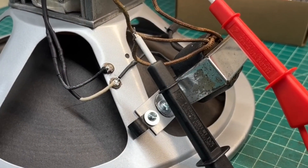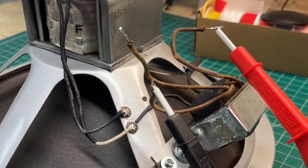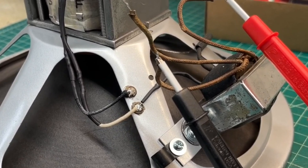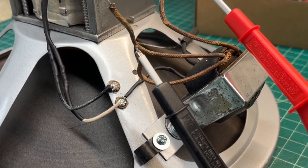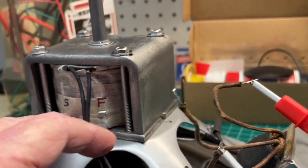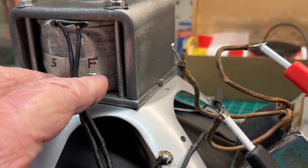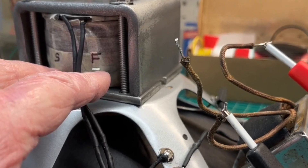So my most inner winding would be this lead. My lead wire color code is somewhat limited due to what I have on hand. My outer winding I'll make green, the center tap will be red, and the most inner winding will be white. For the field coil, when I connect it, the start — which would be the most inner winding — will be black, and the final outside winding will be yellow.